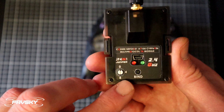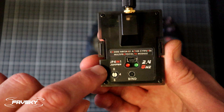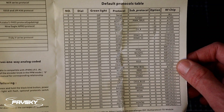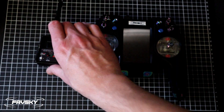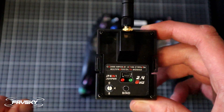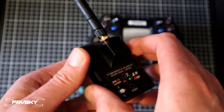The generic version doesn't have the dial, so I assume it only works in serial mode. If you select a particular number you're selecting a specific protocol via PPM, which we don't really want — we want to use serial. There are quite a few available protocols; the concept of the dial is that you select the number corresponding to the protocol you want when running PPM, and use the bind button in that case.